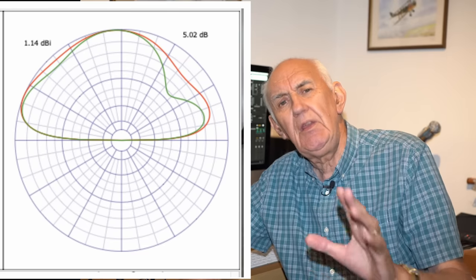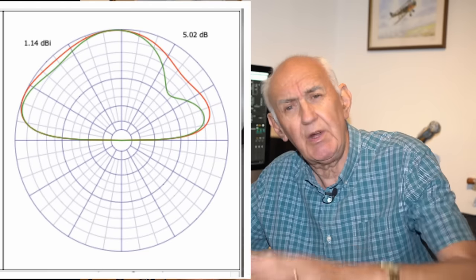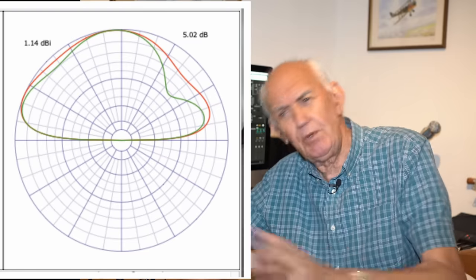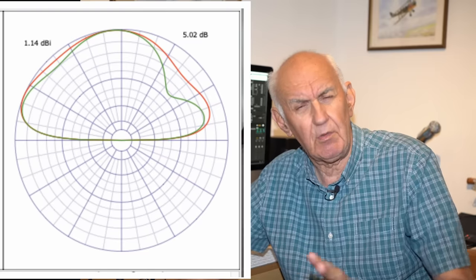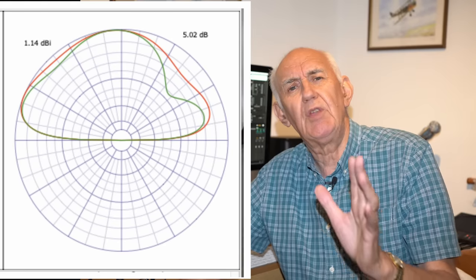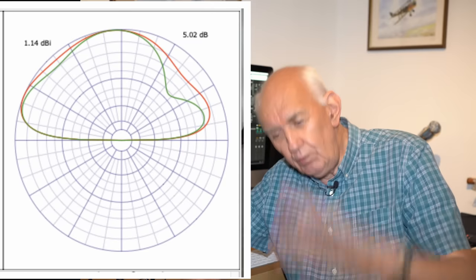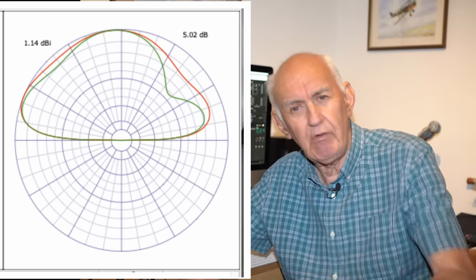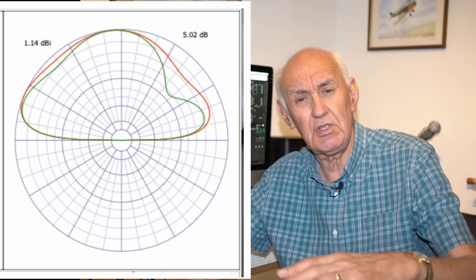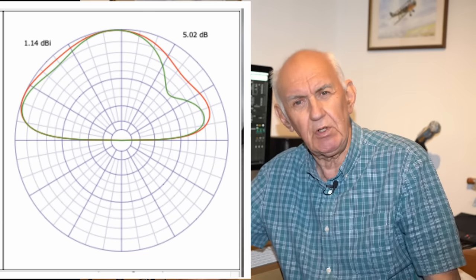But you know, if you've got a vertical antenna with radials that are above ground, those radials clearly radiate. I mean, regard it as a bent dipole. Both elements of the dipole radiate, but of course one's horizontal and one's vertical. So in this antenna, we've got a vertical antenna emitting fairly low angle radiation, which is great for DX, but we've also got a low level horizontal radial, which is radiating, and we know that low level antennas, in other words, antennas close to the ground, radiate high angle radiation. So we've got the best of both worlds.